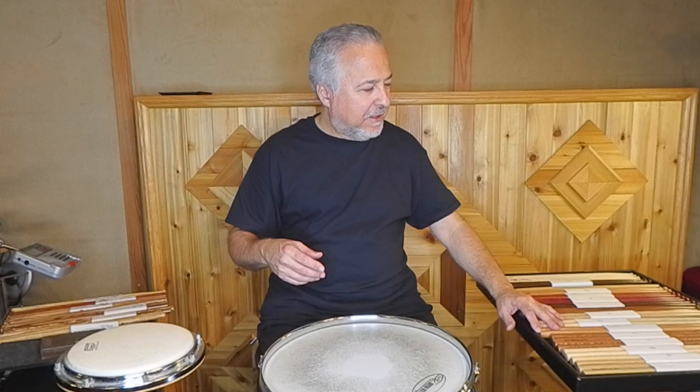It's super dry. I have a meter and everything, and I have a little kiln that I made. So I dry this wood like crazy. And actually, I'll tell you right now how I do it. I probably shouldn't give away all my secrets, but I'll actually cut the blanks, in other words, the dowels. And then the wood will be drying for a couple years. Then I'll cut my dowels, and I'll let those dry for about 6 or 7 months. And then I'll test those.